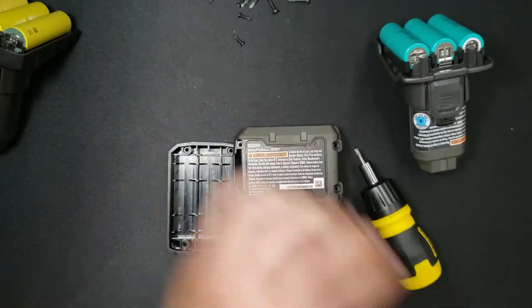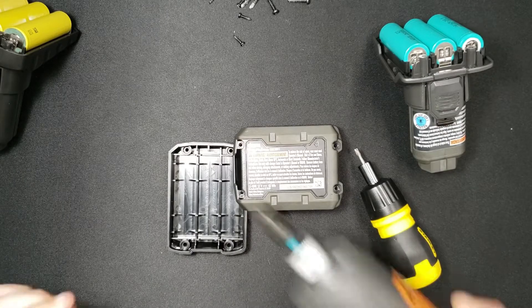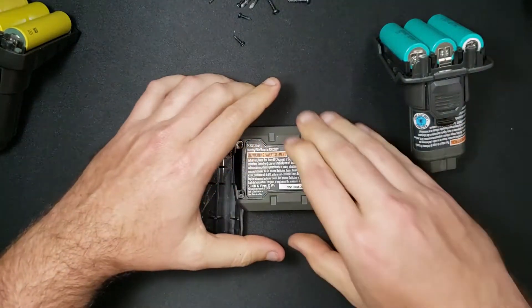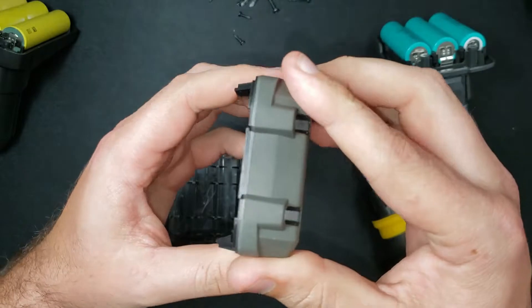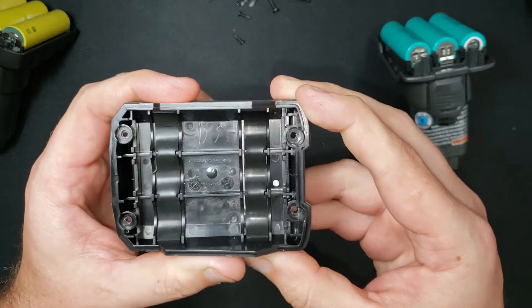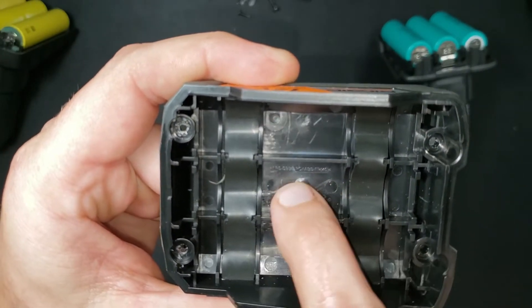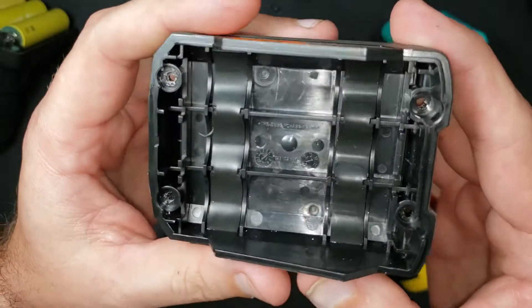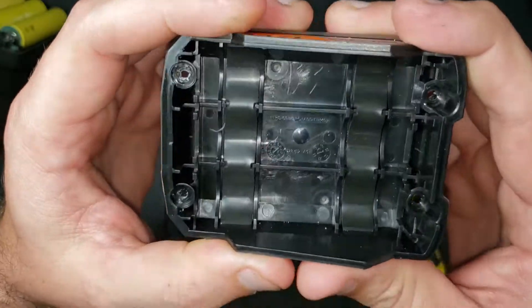TPS-SEBS is a polystyrene-butadiene copolymer — a polystyrene elastomer — which is the rubber used on every Ridgid product. It's common, not high-end, but it doesn't need to be; it's just meant to be a nice durable texture. The hard plastic is PC-ABS FR40 — a polycarbonate-ABS blend — and 'FR' means flame retardant, which makes sense for batteries that can get really hot.